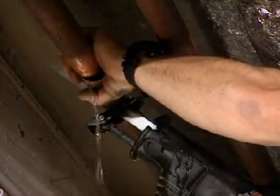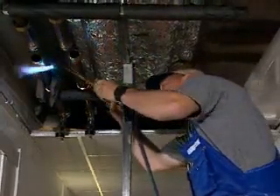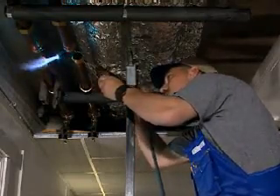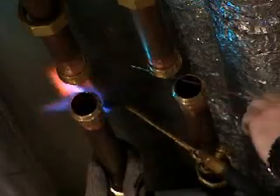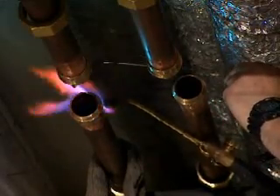It may leak a little through the block depending on a welding joint or other unevenness in the pipe. This does not affect the function of the balloon but may be an irritation when you're welding and soldering. Welding or soldering must be carried out at least one metre away from the blocking point.